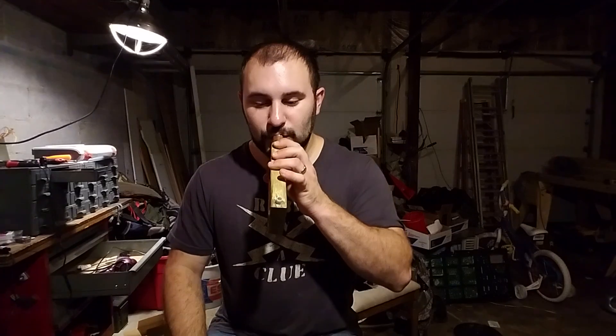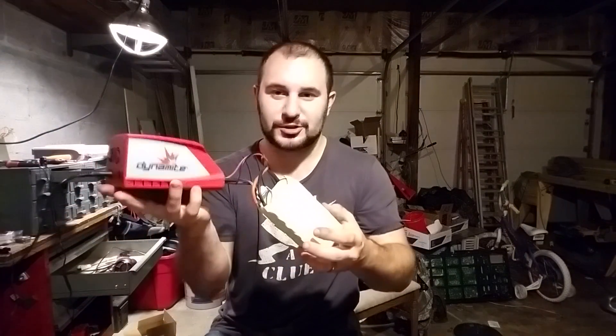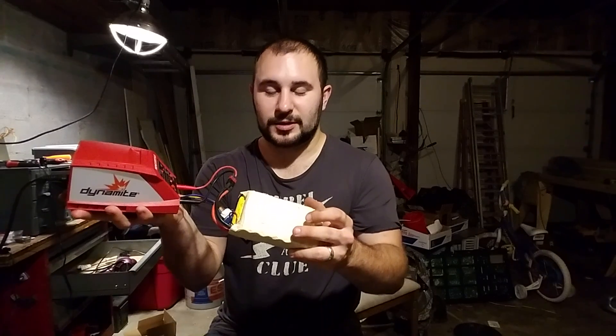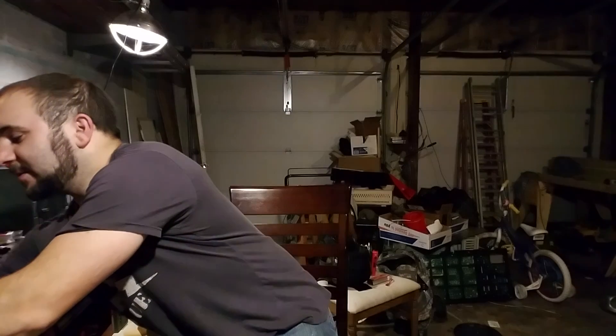Because I built a new 2S battery tonight — all of those Ultrafire 18650s I've been waving around. I finally put them together; I had 14 I was willing to use. I used some pre-tinned copper bus wire, soldered them all up, and it's currently charging with a 2S balance charger. It's a 16,000 milliamp-hour 8.4-volt lithium-ion battery — extremely lightweight, much smaller than my nickel metal hydride battery, and more watt-hours too.